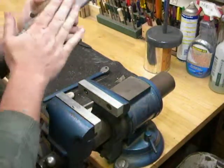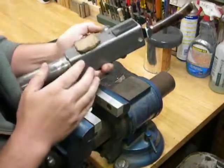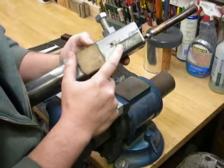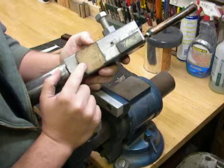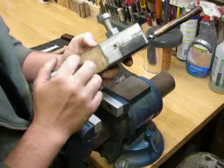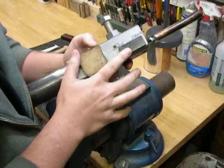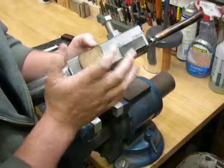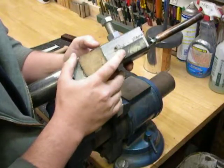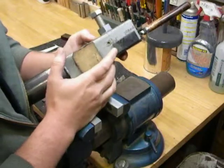So this is what the knife vise is that I'm talking about. It's the one that I use. In case you're wondering why this looks a little funky, I have a hard piece of rubber and a piece of abrasive belt cleaner stick, like most of us use on our belt grinder. Hacked a piece of that off. I super glued those to the side of the knife vise, and so when I'm shaping a handle, I can tap a file against the hard rubber piece here and knock out quite a bit of the swarf. I don't have to use a file card as much that way.